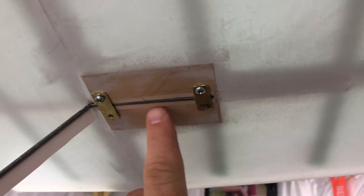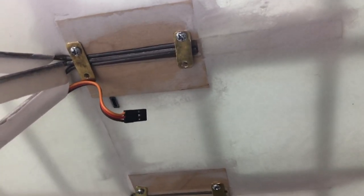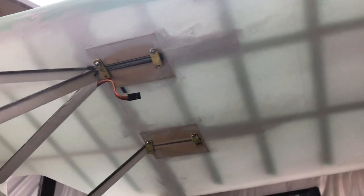I had to fill in these pockets a little bit with wood just to get the wires to fit flush, and then I had to create these brass straps. Each one is cut from brass sheeting I had on hand — I ground off the sharp bits after cutting, hammered it flat, then drilled them out. The screws are pre-drilled, put in, then pulled out; I put some thin CA down the hole, let it harden, then clean the screw out again.